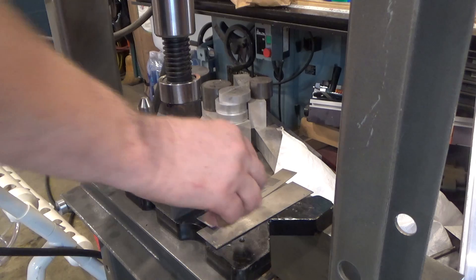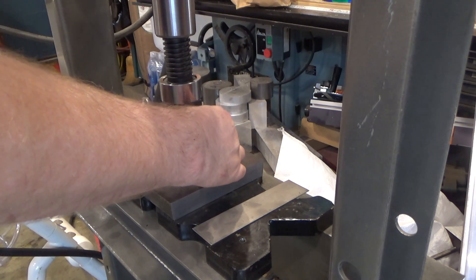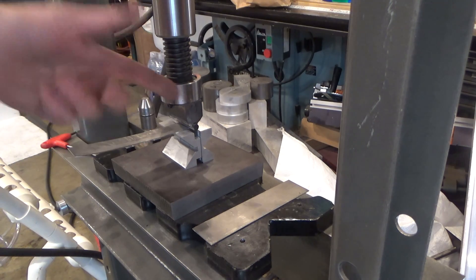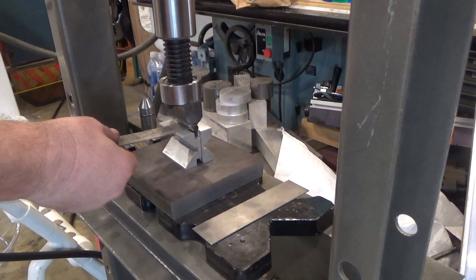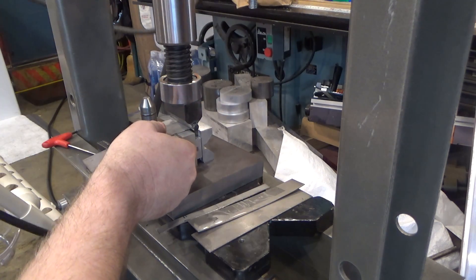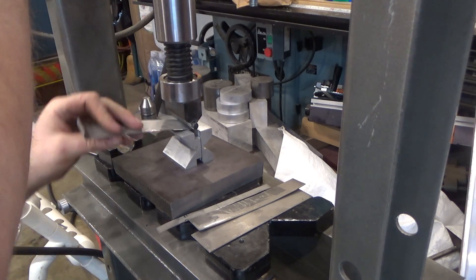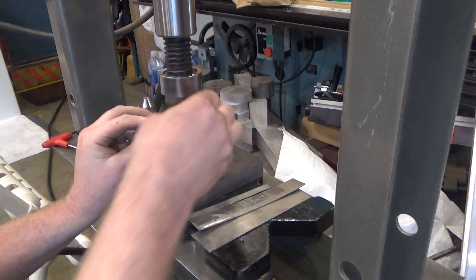This turned out to be too wide, but it sort of works. It's an aluminum angle block that I built during my time in machine school — one of the first projects I did. The forces here are so low that I can easily form these things inside an aluminum block without it deforming. The beauty is it can't catastrophically fail because it's soft — it'll deform first. There's the first curved side. Hopefully this thing seeks its own center.